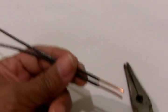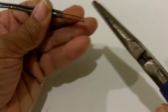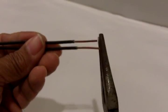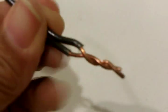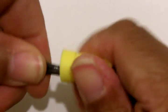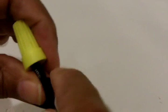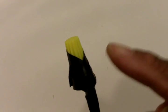Now I'm going to show you how to do a wire splice with a wire nut connector. I've got two hot wires to join together. Grab the tips with needle nose pliers — Lineman's pliers is another option. Bring the two wires together, twist them, and you'll be left with a twisted pair. Then attach your wire nut by twisting it on tight. For added safety, I always like to wrap the wire and the wire nut with a little electrical tape. That's a firm, secure connection — this is how you make a good wire splice using a wire nut connector.